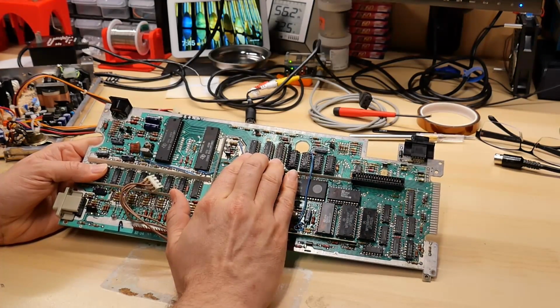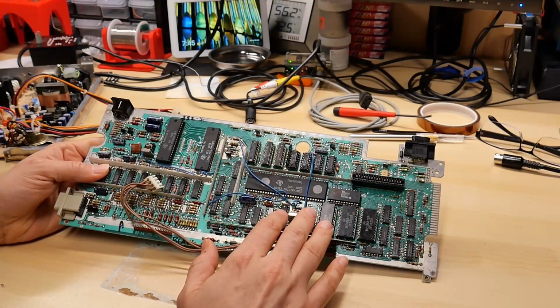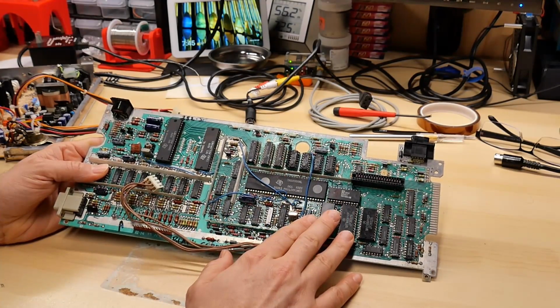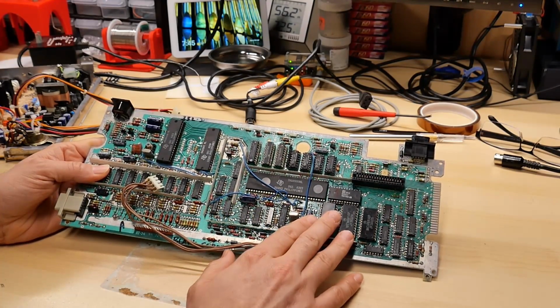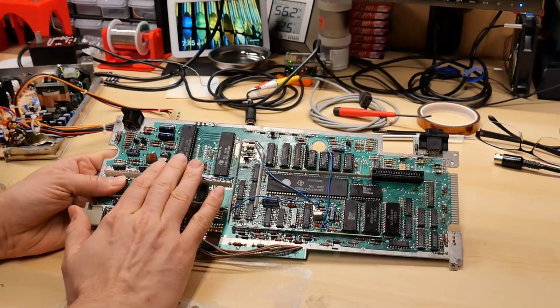I know these 3 ICs are working, and when I switch around the RAM chips, it seems to have no effect on the strange things I'm seeing on the oscilloscope. So I kind of fear that there's either something wrong with the CPU, or perhaps both of the graphics chips I have are bad.